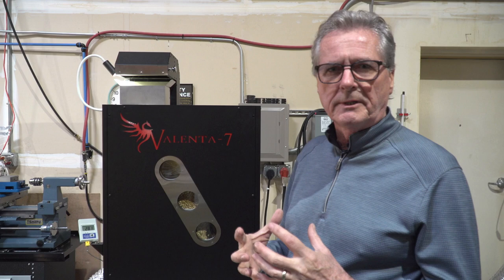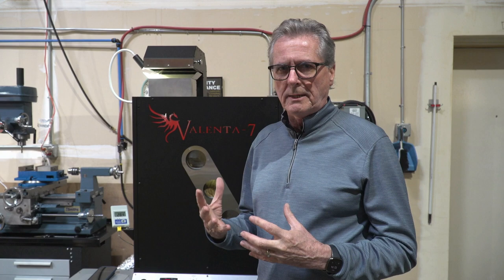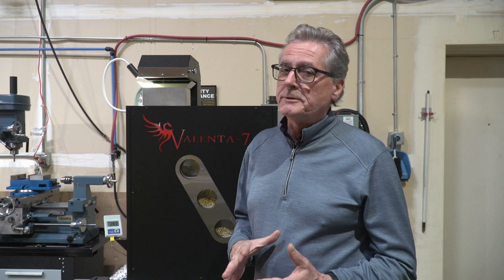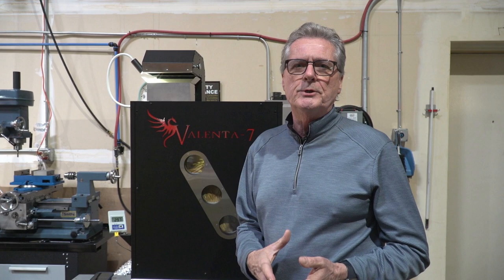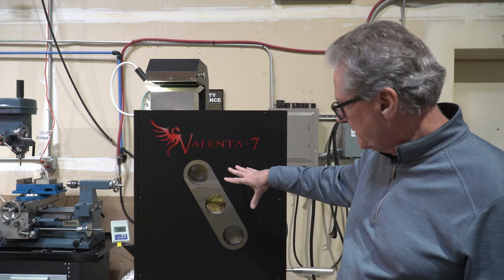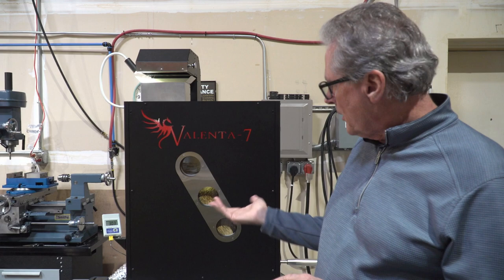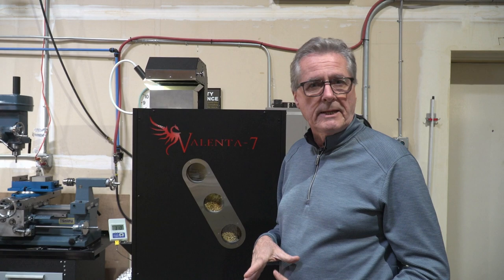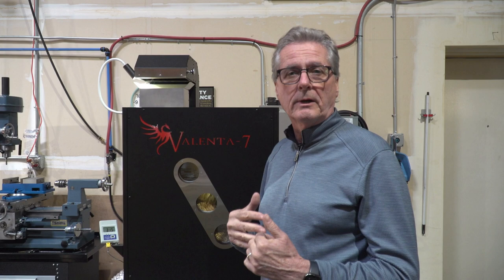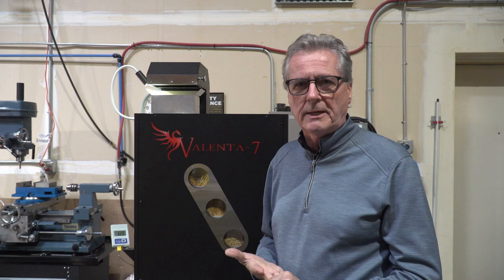The heat transfer is a lot more efficient — it's really transferring more heat at a lower roast air temperature and bringing it up gradually, so we're roasting faster at a lower roast air temperature. We also harvest hot air off the stack through the heat chamber and cycle that hot air down into the intake of the loft blower. In early prototypes before we started doing that, we shaved off about four minutes of time from the same heat settings and load size settings, making it a lot more efficient.